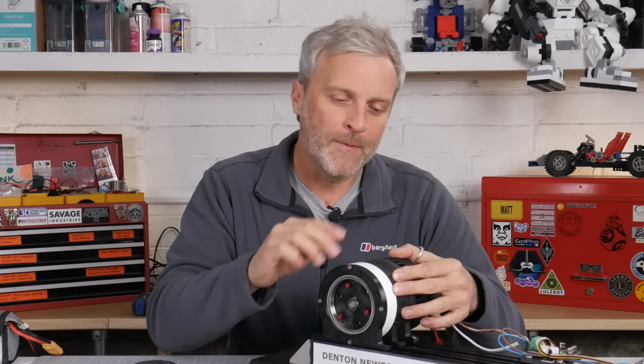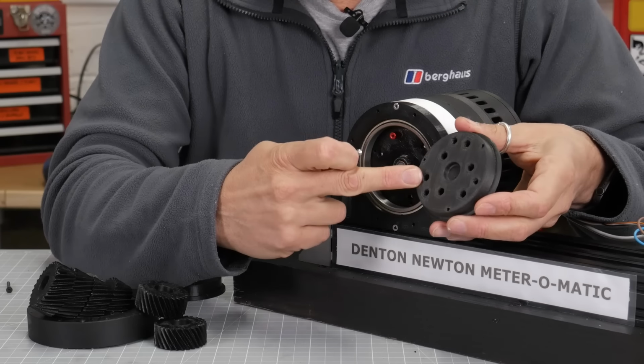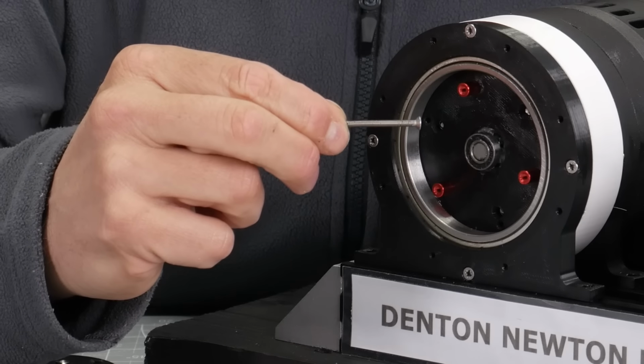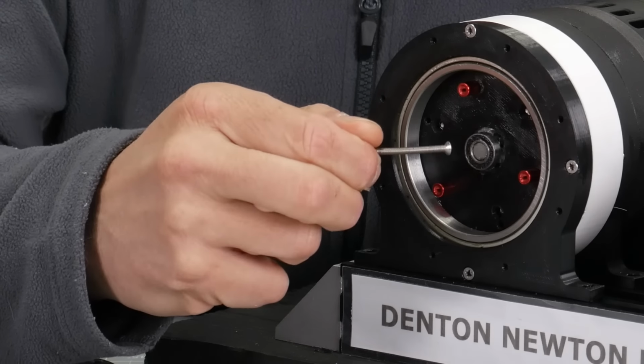I've switched out all of the PLA carbon-filled gears because I think the carbon-filled element is going to cause more friction in the gearbox. So I've replaced it all with the IGUS gears that I printed earlier. That's why there's a white stage here now. However, when I took it apart, I noticed that there was some pretty severe damage on the output stage. On the initial design, the final output stage was held on to the second stage gearbox using 6 M3 stainless steel bolts. And you can see just how bent that bolt has become.